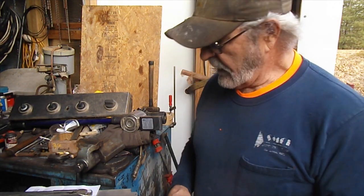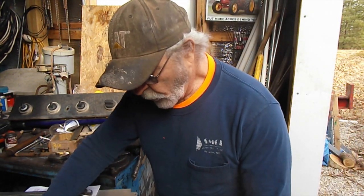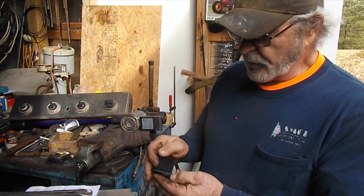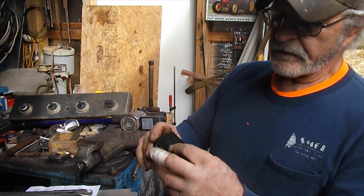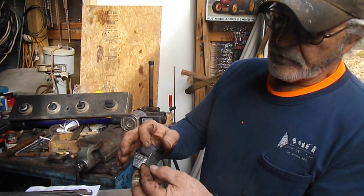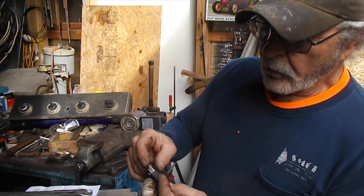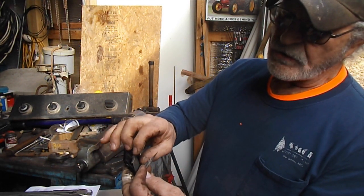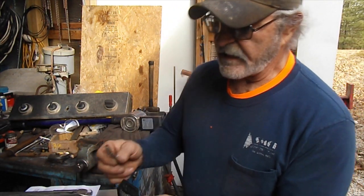I did not service appliances hardly at all in my life — I worked on all the larger equipment. But once you get to number 60, if you require a size that's a little bit smaller than that, you go over to your next drill index. You can see this one here is about the size of a matchbook, and it's got about 20 drills in here. It goes from number 61 — picking up where the little one on this kit leaves off — all the way to number 80. By the time it gets down to number 80 in size, which is .013, so 13 thousandths of an inch diameter, it's pretty difficult to use. That's whenever these pin vices come into play. You go ahead and chuck that drill bit into this pin vise — you can see it actually opens and closes, not unlike a chuck on a drill or drill press.